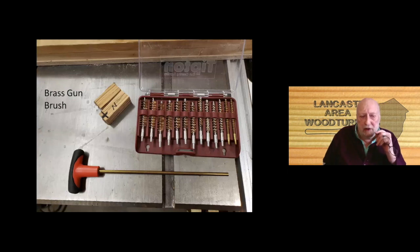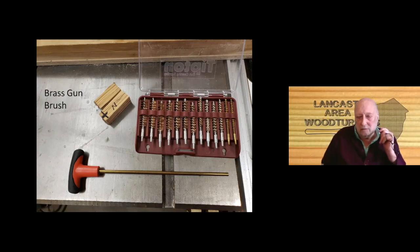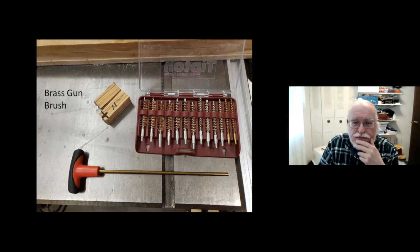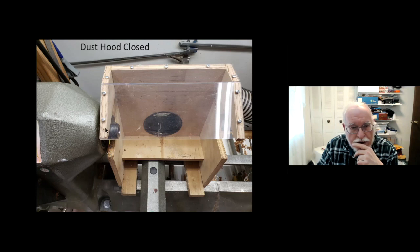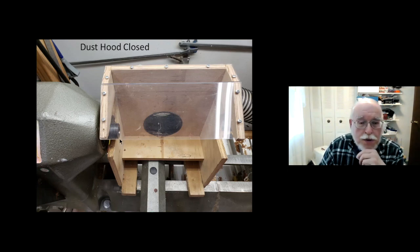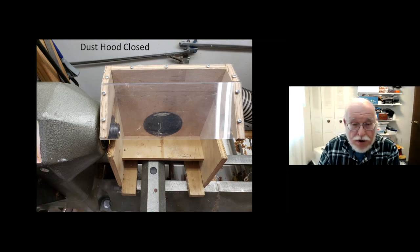This size specifically — you can make small things like bottle stoppers, duck calls, anything like that, and again this isn't unique to me. The only critical dimension is this little cutout sized to the distance between the spindle nose and the bedways on your lathe, so you have to customize it that way. It looks like it would only work with pen mandrels, but I do use it with my sanding jig — we'll get into that in a few minutes.